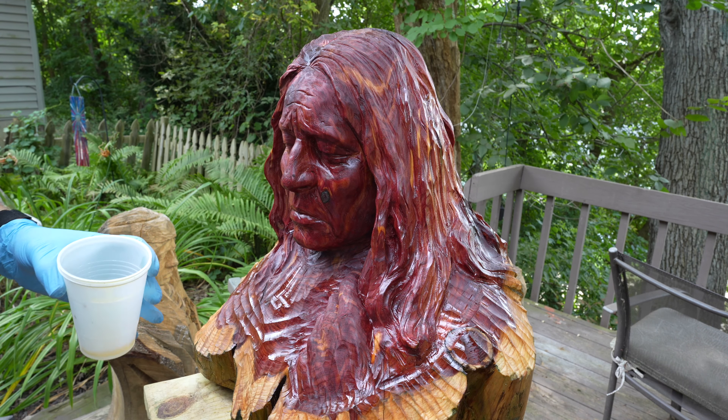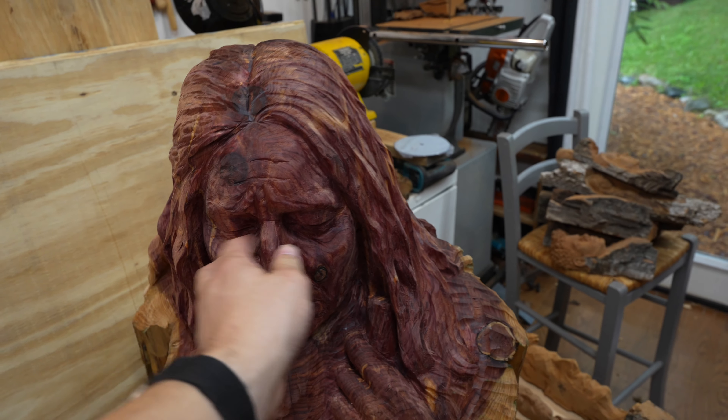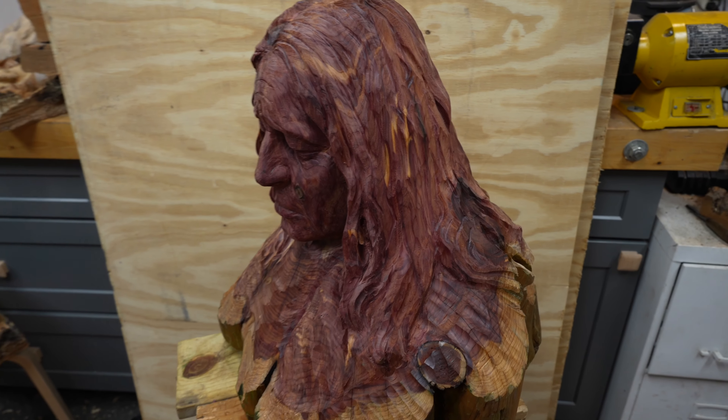All right, beautiful. I'm going to let that soak in for a bit and then wipe off the excess with the towel and my dry brush. Here's the carving a day later — I've applied the finish and let it soak in. You can see it looks pretty dry. I'll continue to repeat that process four or five times over the course of the next four or five days: applying the finish, letting it sit for 40 minutes, dabbing off any excess, then one day's dry time. That's going to leave us with a nice, soft, matte finish — not a very shiny finish at all.